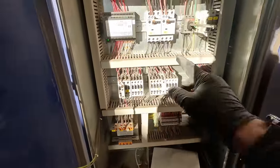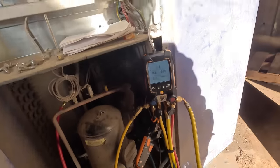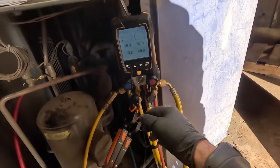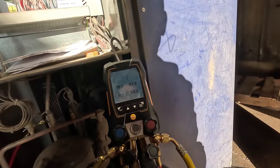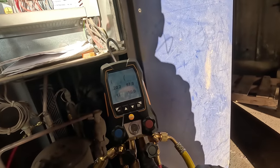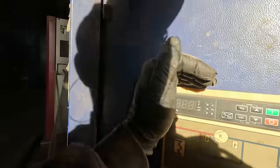You've got the fancy contactors — can't see much. Here are our pressures and temperatures: we're running 19-pound suction, 50-degree condensing temperature. We are low — it's pretty obvious. Before we just go pumping refrigerant in, we need to talk to these people and find out if this is an ongoing issue.